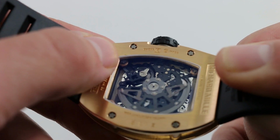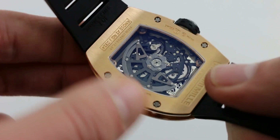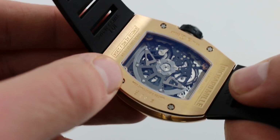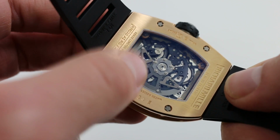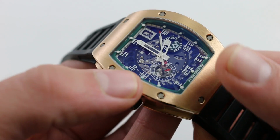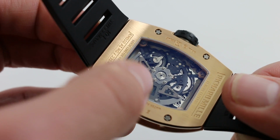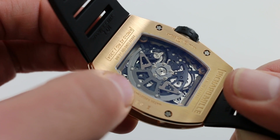Now, you'll also note that there are anchors at all four corners that allow the watch to be mounted on elastomer suspension so that shock is further attenuated when the watch is on the wrist, isolating the movement from disruptions of the forearm itself. Finally, there are ceramic rotor bearings at center, so the materials theme of this watch: natural rubber, carbon fiber flange, sapphire, rose gold, titanium, and of course ceramic. The rotor bearings themselves being unlubricated, high-efficiency units paired with an exceptionally efficient unidirectional winding action.